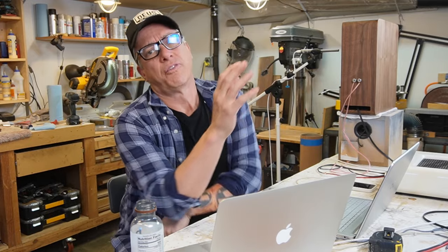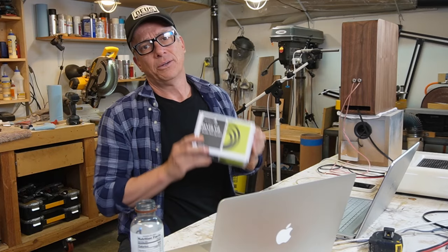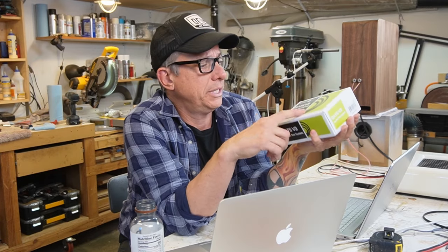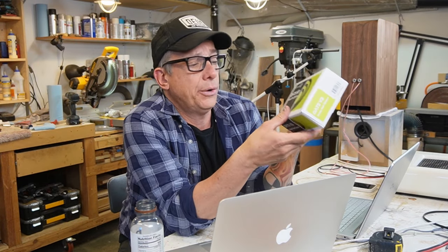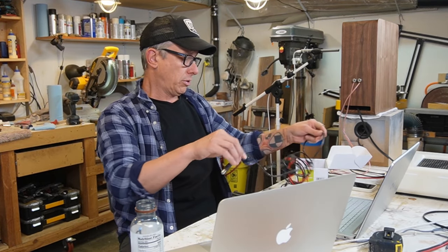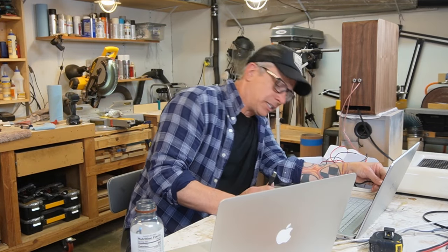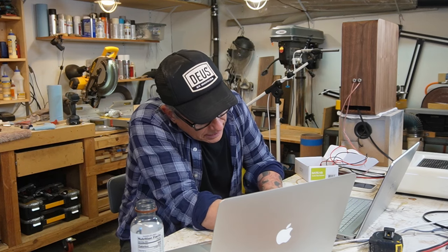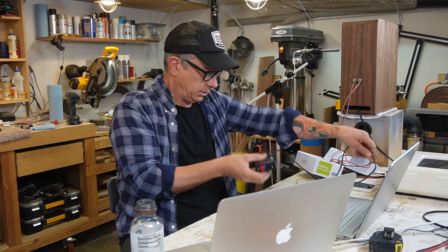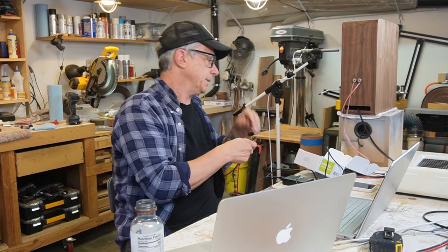And now for ZMA, it's the impedance file. We need something else instead of REW and the microphone. Now we need DATS V3, Audio Test System. Okay, so I'm gonna connect this DATS here on my computer. We don't need the amplifier anymore, and I hope it works. I wish I had everything on the same computer, but it seems kind of impossible. So we plug the wires in, and we're gonna measure the impedance.